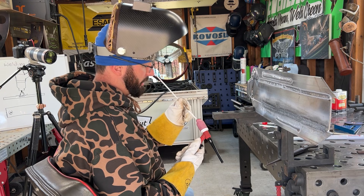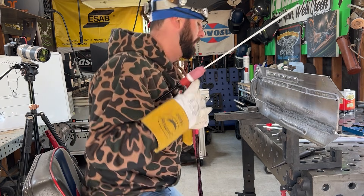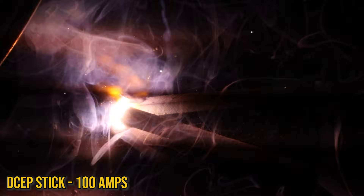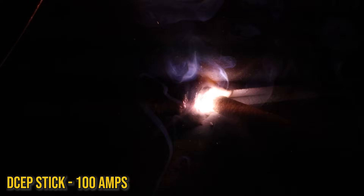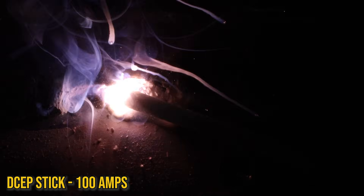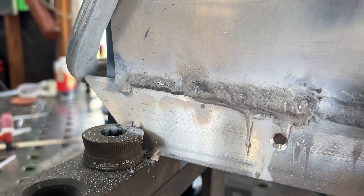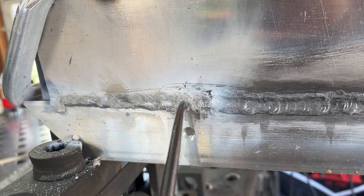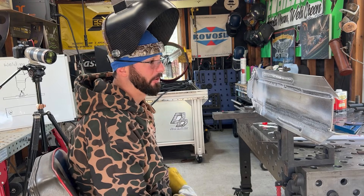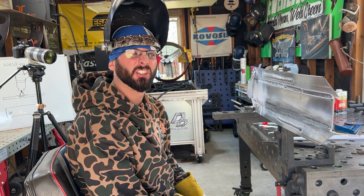Just for comparison, I'm going to run one of these aluminum stick rods on DC positive to see what happens. I haven't run one of these in a long time and I hate welding with them. At about 100 amps that thing just disappears — a hot rod popped right into my pants too. There's no point in using the TIG torch with stick rod as filler versus just stick welding normally — it went way faster and looked cleaner. So, can you DC negative with stick filler? I guess. Should you? Nah. Just do one or the other.